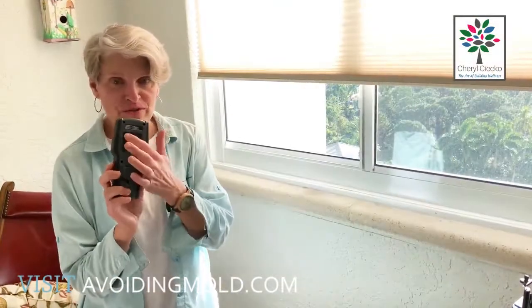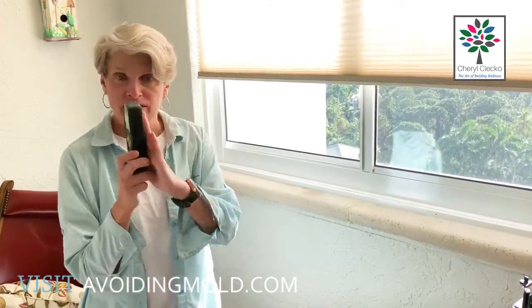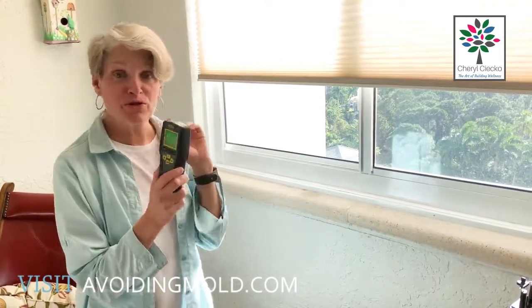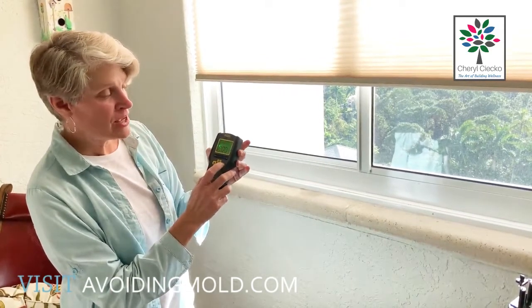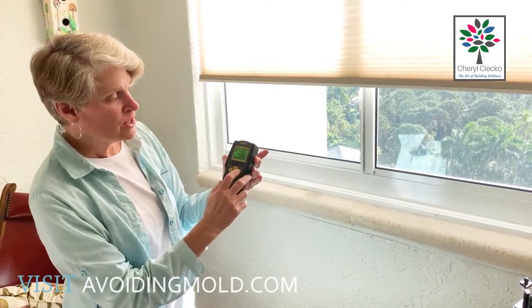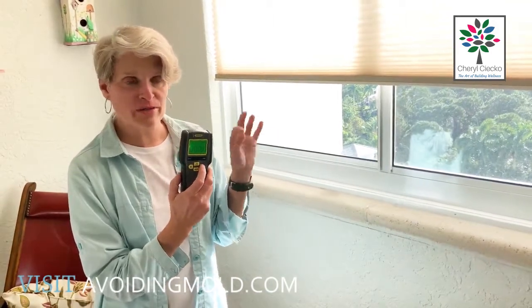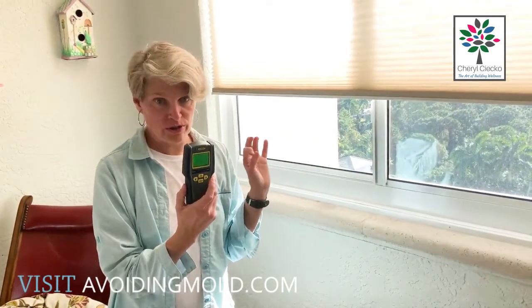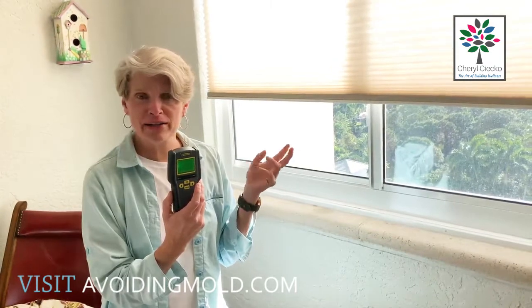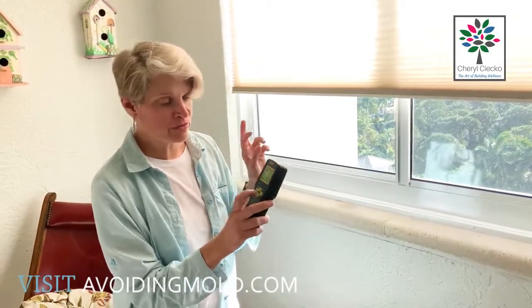So this pad in the back — if I touch it, it's beeping because it's measuring the moisture in my body. That would be too much moisture to be in a wall because right now it's set on a wall setting. This particular meter has a wall setting, masonry setting — I'm doing the arrow button — softwood and hardwood. Hardwood would be hardwood flooring or finished cabinets, things made from trees with leaves. Softwood is usually structural wood — fir, pine — typically what we use in North America for structure. That's where you'd use the softwood scale, it would be a different measurement.